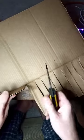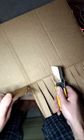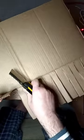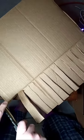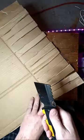Oh, yeah. Other knives that we tested. We tested one that I made with 1095 and one that I made with O1 tool steel. Those were the other ones I forgot about, if our homie that was asking is still in here. My edge on the 1095 wasn't great, like my edge profile. The grind wasn't great, and I don't think I got the heat treatment 100%. It took an hour before it went down. The O1 tool steel took like 2 hours before it wore out.